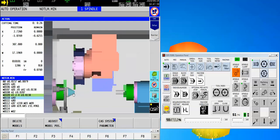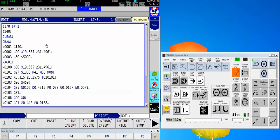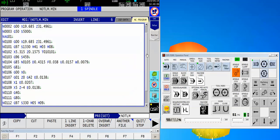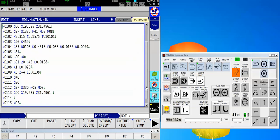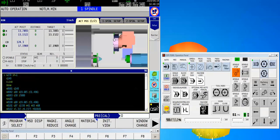Here's my tool shape, and as it's running I'll go ahead and open up the program just to show you that there's really nothing special to it. I am using the G85 turning canned cycle with a couple of little adjustments, but that's it. It's just roughing — I'm not even finishing the part, there's not even a G87 in there. But this particular program does not have the redundant tool features.